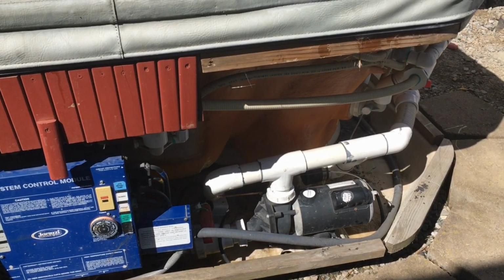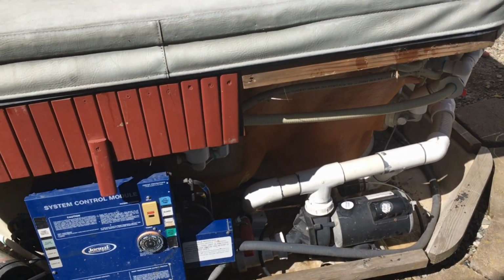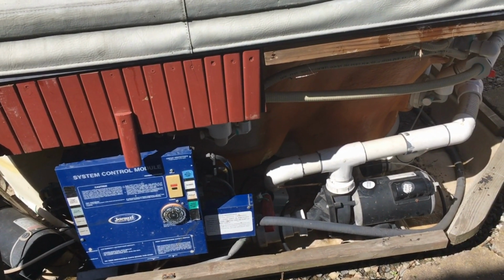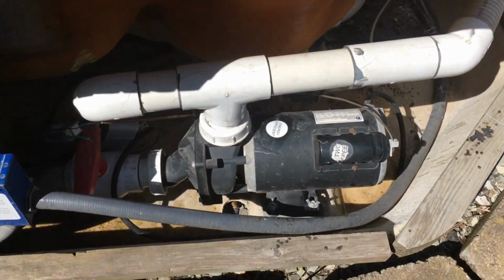element. There's two wires on the top. You can just touch the two wires. Usually if you have a heater element burn out, it will sometimes trip the circuit breaker. That's when it grounds completely to the chassis, but it doesn't always do that, and I'll show you guys in a second. In my case, the heater element was down here at the bottom.